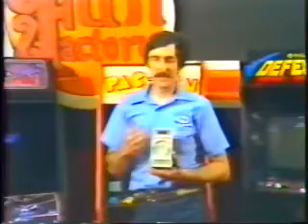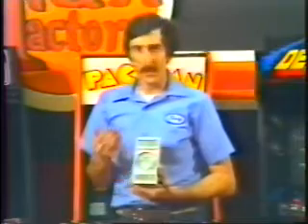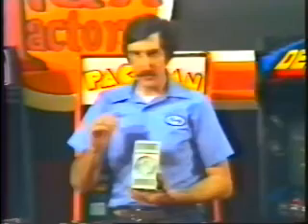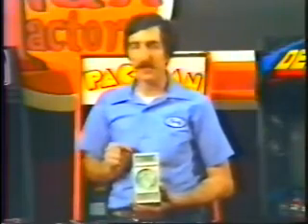The piece of test equipment you want to use is called a digital multimeter. This particular digital multimeter is made by a company called Beckman — it's the Beckman Tech 310. Like other digital multimeters, this meter can be used to measure AC and DC voltage, AC and DC current, and resistance. There's also a very special range called the diode test range, which lets us test diodes and transistors without buying a separate piece of test equipment. During this lesson, we'll be taking a look at the digital multimeter and effective ways to use it to repair electronic games. Let's take a closer look at this extremely versatile piece of test equipment.